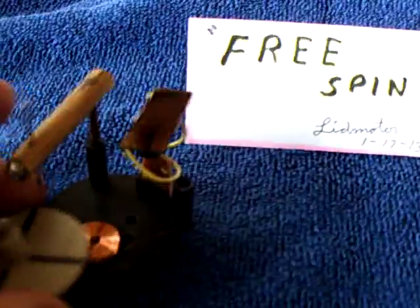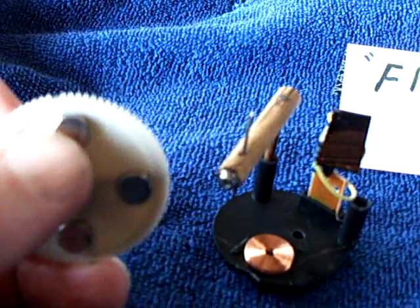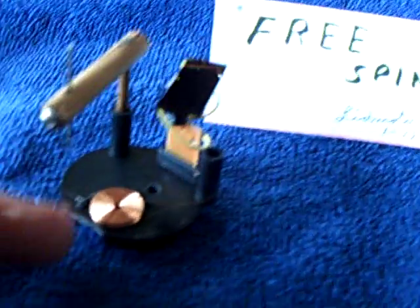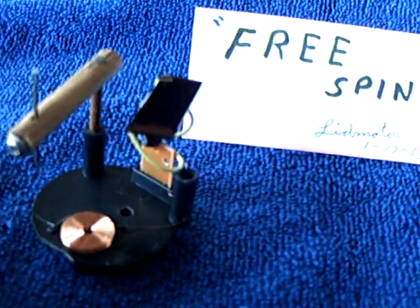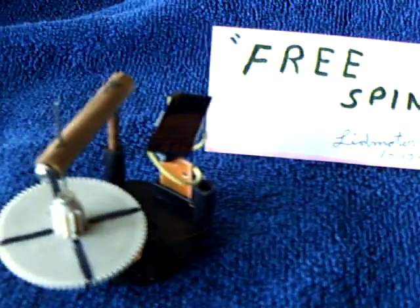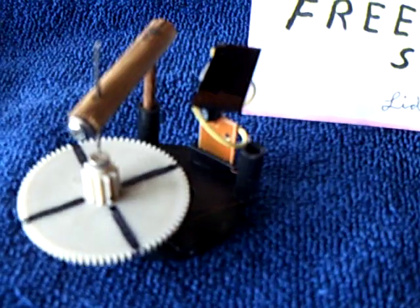This was a rotor that had magnets facing down, which I hadn't done before — at least on a project like this — and they're all one pole. That's one pole that pulses. And when it gets up to a certain RPM, there's feedback going back through that coil, and it causes this circuit to fire on its own with the magnet going by it. It's a little different than some of the other pulse circuits I've worked with.